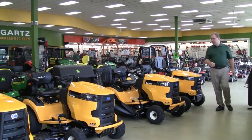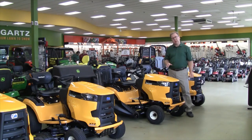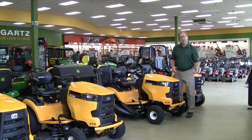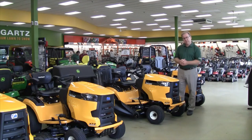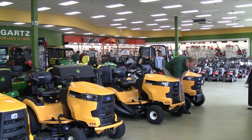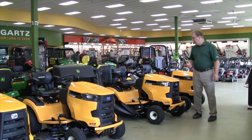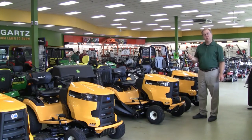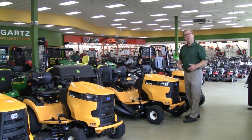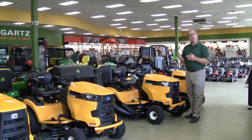Moving into the XT2 series — as I mentioned, they're both on the same chassis. The key differences on the XT2: first off from the front, you'll notice the front bumper is standard, which gives you added protection if you should hit something — it protects the front grill and hood. They go to a turf master tire for increased traction and durability. They upgrade the battery for longer life and better cold weather starts. Also in the front axle they use a bearing, typically found on much higher-priced tractors, which will give you much longer life than the bushing on the XT1.